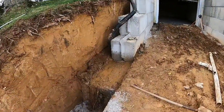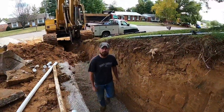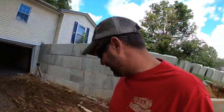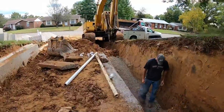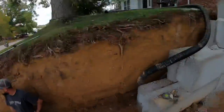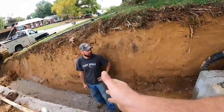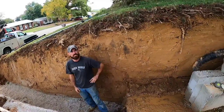All right guys, I think we're reset for another block setting episode. Does that make sense? Sure. Sometimes I just talk and I hope you guys get it. So what I did here on this one is I got a little bit of this dirt out of here and built up on the driveway so I can come up that other edge over there. It's going to be a little bit of a stretch to reach a couple of these blocks. We want to go about another 12 feet or so? Actually, even closer. 12 plus 4 is 16 total.